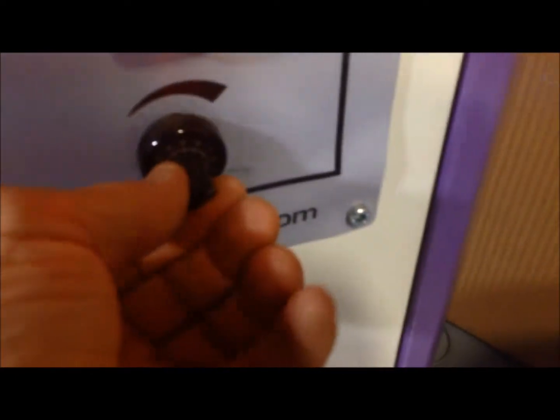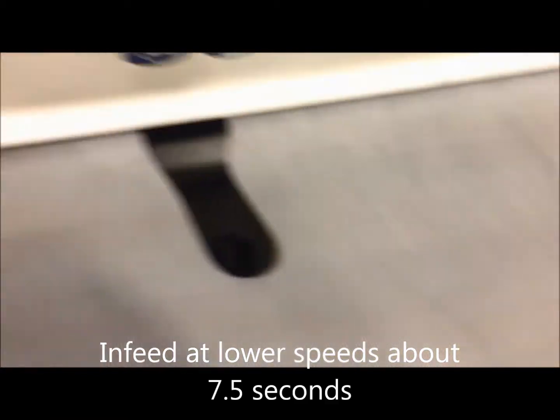On these parts we may have to work a little bit harder. You can see that we are not removing the coating. We have a little bit of a grain on top of it, but it's actually not looking bad. I am going to increase the 2.1 to 2.7, and I'm going to reduce my speed just slightly to 6. It could be that these parts are a little bit thinner than the galvanneal parts. It takes longer, and I'll give you the throughput time for this part.